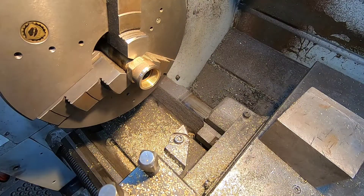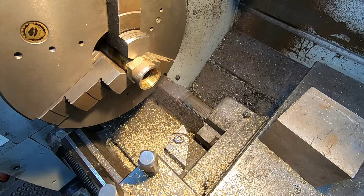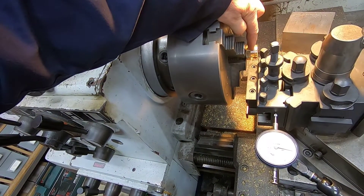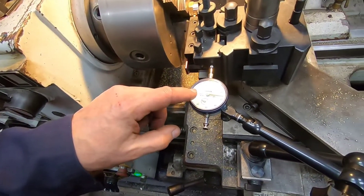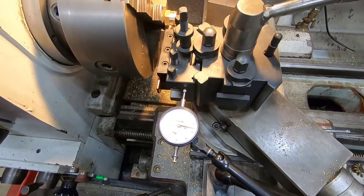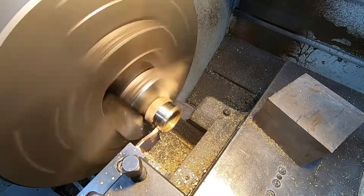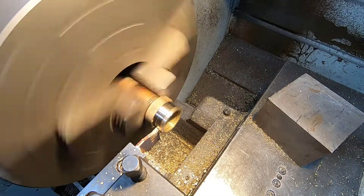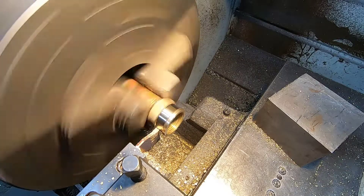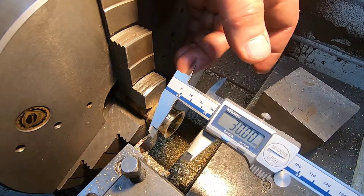33.01 — that's going to be close enough. Alright, so that bit's done, and now I'm going to do this bit down to 30. That's where I went wrong before — I did it all down to 30. I've changed the setup because now I want to do this diameter and there's a 45-degree taper there. I've got it set up so I can use a dial gauge to measure the infeed of the parting tool. I was shooting for 30 — I guess I got lucky and hit the mark.